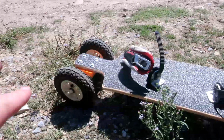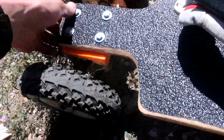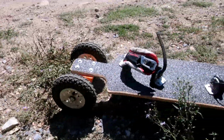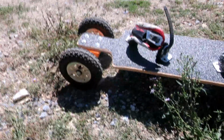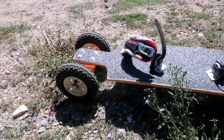So I want to try to reduce the hanger roll on this board, which was what was happening, where it's kind of side loading, and you move the load sideways, it causes the hanger to kind of just roll sideways regardless of what the rider is trying to make it do, and that's not good. So I want to fight that, and I also want to make the board more stable. And one of the ways I can do that is by dropping the roll axis of the deck.